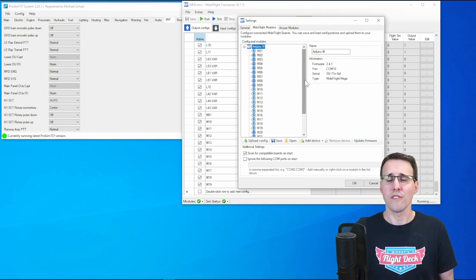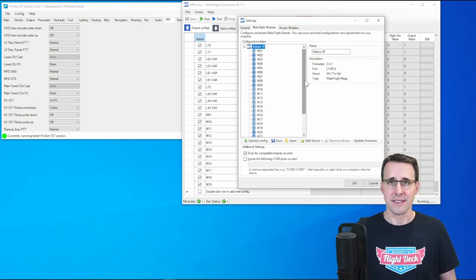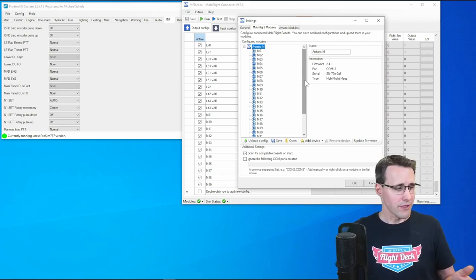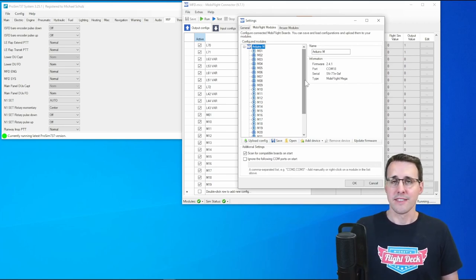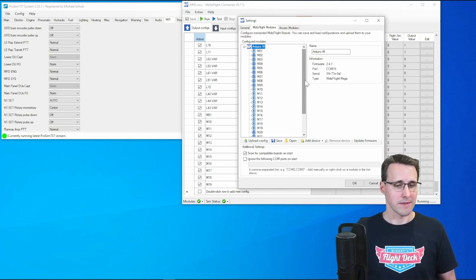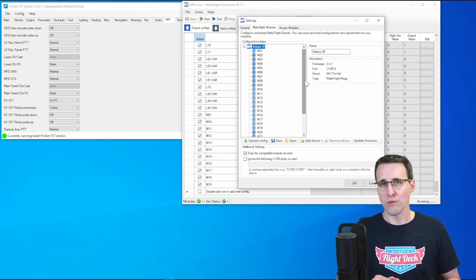And this offers the possibility to just use three pins for controlling many more LEDs. I can control all the 11 LEDs here on this panel with only three pins on my Arduino. And this is something I will make later here with my hardware.